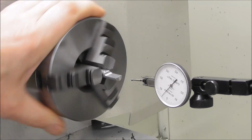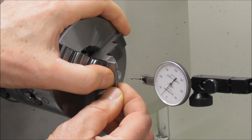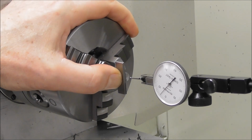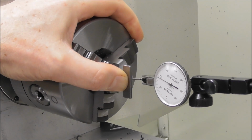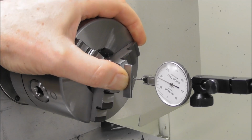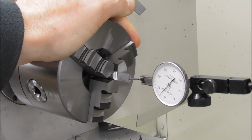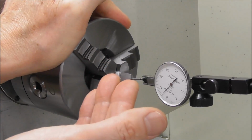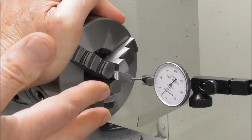it's holding position. Now if I turn that 180 degrees, and let's put a little slip gauge on there, just something with a flat surface. You could use a little bit of ground gauge plate or something. If I bring the dial indicator in close to the end, now slide that over with it roughly vertical. See, I'm getting, yeah, very close. I'm getting almost exactly the same amount, but whatever difference you get there is actually, because it's a generated system, you know, you're turning it and measuring it and turning it and measuring it, you're actually generating a measurement that is far more accurate than using a gauge.